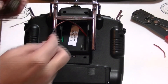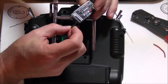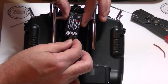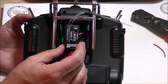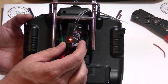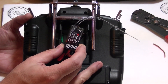Now we're going to plug in the receiver. I'm just going to plug this into the battery for now. I haven't bound this with anything or set it up yet — we're going to do that in another video. I'm putting the bind plug in here so when we power it on we can actually see it blink — see the orange light blink. I'm going to power it on, and there it is, it's getting power. You can hear my radio power on. So I'm going to bind this to the other radio, and then show you the programming inside the Taranis to get everything set up and configured for trainer mode. Looks like it's working.